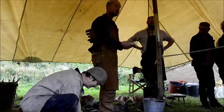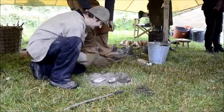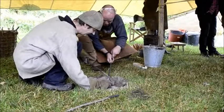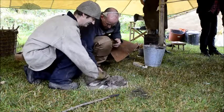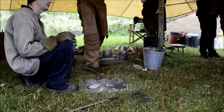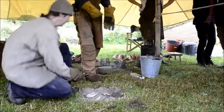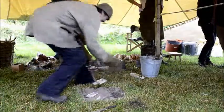The wax process came a little bit later when people started to keep bees, mainly for the wax. Normally you would break these molds to get the bronze out. I was just lucky that the first time I used it, it split perfectly in half — so this is the second time I've used this mold. Normally you would just crush them. Those you can only use once, while stone molds you can use over and over if they survive.